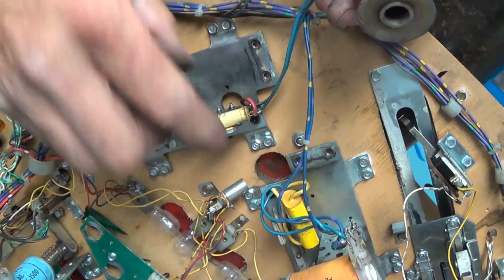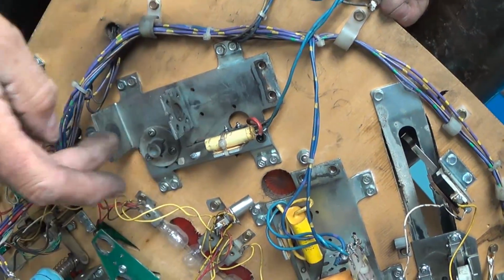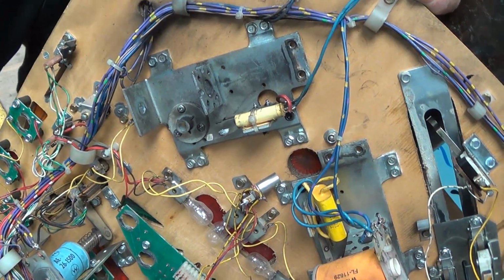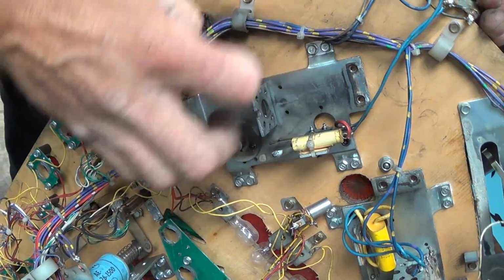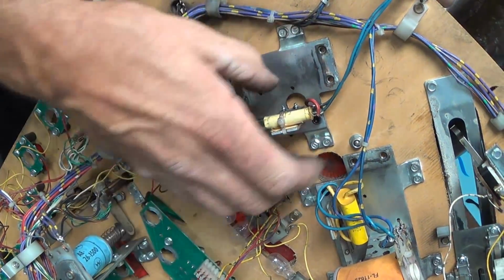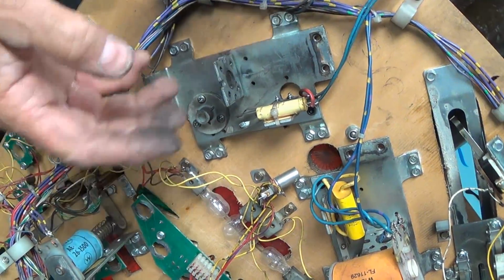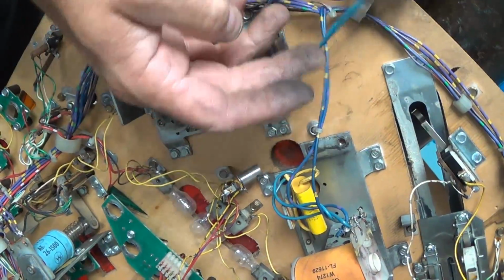And then you would take the assembly out, and it would hang with the coil, and then you'd wash the plate, replace the hub, replace the rubber end stop, which just pries right out. I've seen games that are missing it. Then you would put your new hardware on, replace the coil, end stop, and bolt on the EOS switch, and then you do your soldering after all that is bolted on, because then it's easier to do everything in place. You don't want to solder a coil hanging like this; it's too hard.